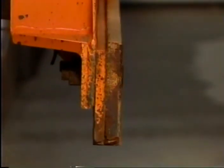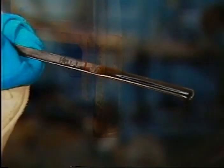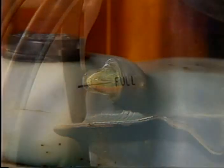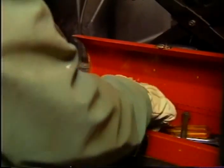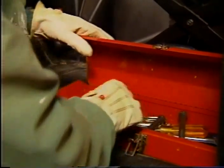Next, check all blades. Look for any cracks and make sure there are at least two inches of blade beyond the moldboard. Check fluid levels: engine oil, engine coolant, and window washer fluid. Look into the toolbox and make sure you have an extra supply of shear bolts for both the plow and wing. They can break often, so don't get caught without extra bolts.